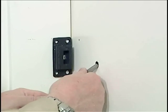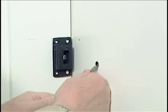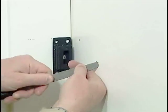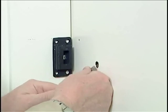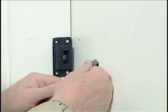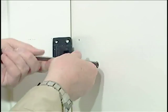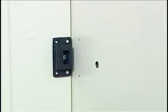We want to take either a file or a rotary burr and clean off the rough edges from our spindle hole. There's going to be a brass spindle that goes through this hole, so sharp edges don't present a structural problem. It's just a matter of taking them off — it's a more professional installation, and if the burrs aren't there, they won't create any problems down the road.